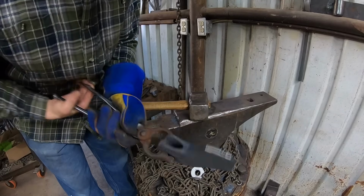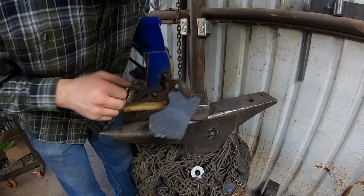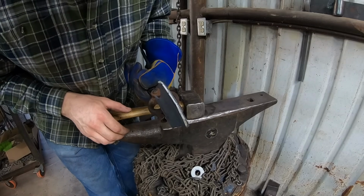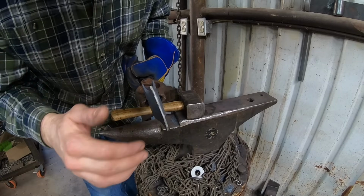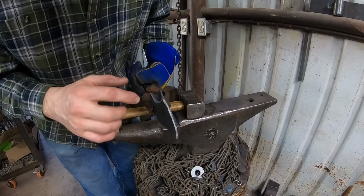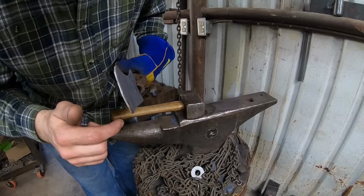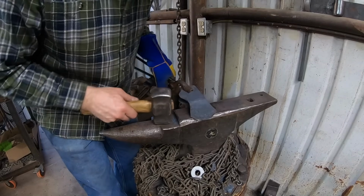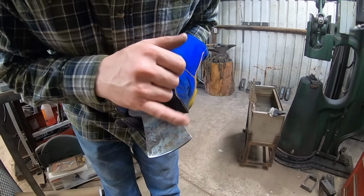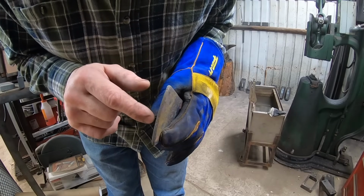Little surface, just texturing really from forging will provide enough of a start for a crack, but you can see how deep those cracks are. I went back and checked this axe too. Only quenched it once, but it's also cracked.